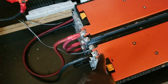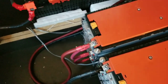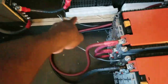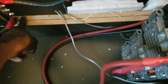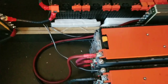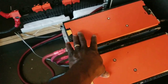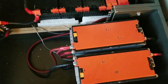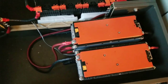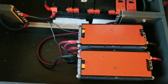This one's going to be changed — the batteries are going vertical. I haven't even measured if there's enough clearance to connect the terminals. I may need to cut this side open to make more room. I don't want to do that, but if I have to, I will — I can't stack two more here because the box won't close. Right now they're running three in parallel, then series, for the current 24-volt configuration.